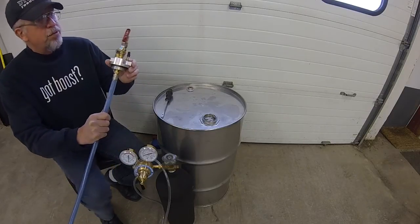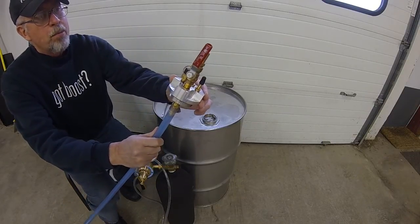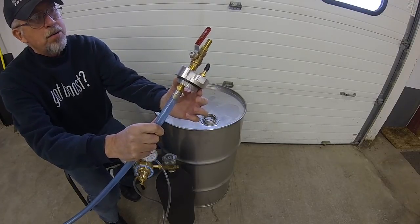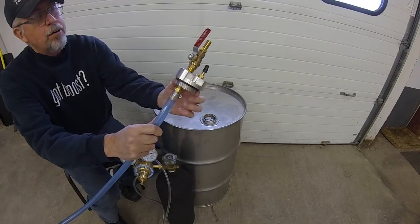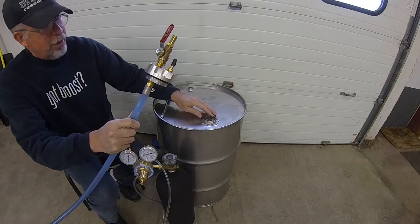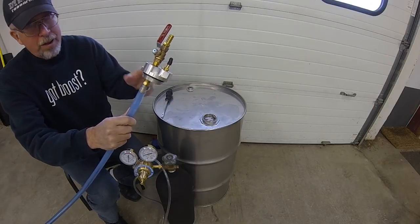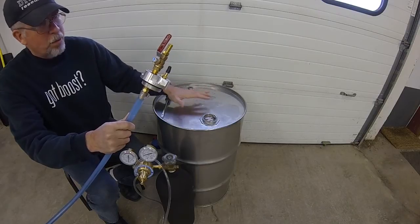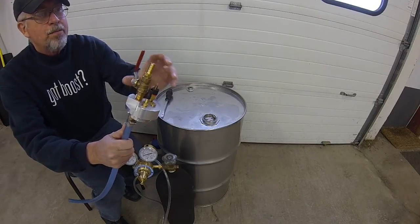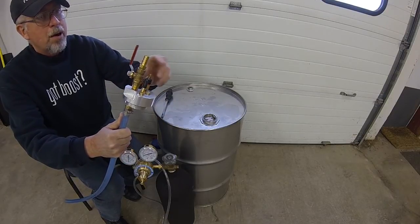What we've got is this billet aluminum bung, which has in this case a tapered VG2 seal and a rubber seal to match the new-style drum fittings. The old-style drums have a flat gasket, and there's a flat gasket that comes with the kit in case you have old-style drums. The drum preserve unit has a ball valve for controlling the flow of fuel coming out.